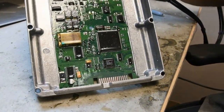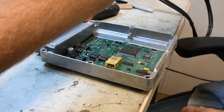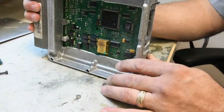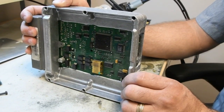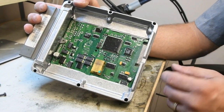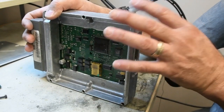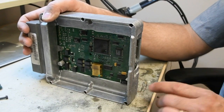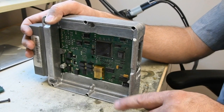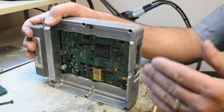And if you can clean it like that, you're pretty much guaranteed not to have a problem with your chip installation. So once that's complete, just put the PCM back together and install it in the truck. When we install the PCM in the truck, the one thing that we do recommend is that when you do have the chip plugged on, put a piece of tape or something across the back of it to keep the chip from vibrating. It's a spring contact, but any kind of vibration can cause it to loosen up and that could create a connection issue. So make sure that you tape across the back of it. If you do reinstall the black case that goes around the computer, do not put the bolts back in the two holes. We do provide a small piece of zip tie that will go in the lower hole and it'll strap the case to the bracket so it doesn't rattle, but it doesn't put any pressure on the back of the chip, which can cause the chip to shift and lose contact.